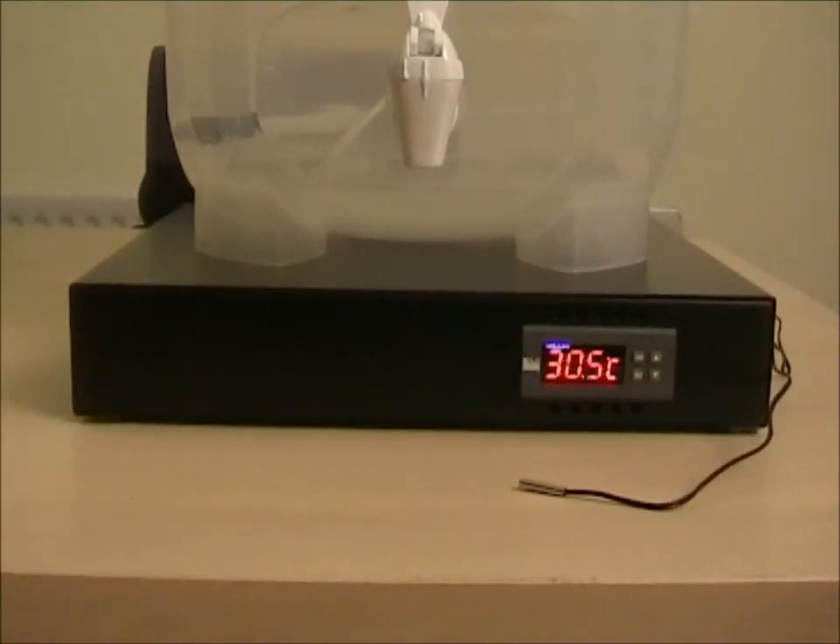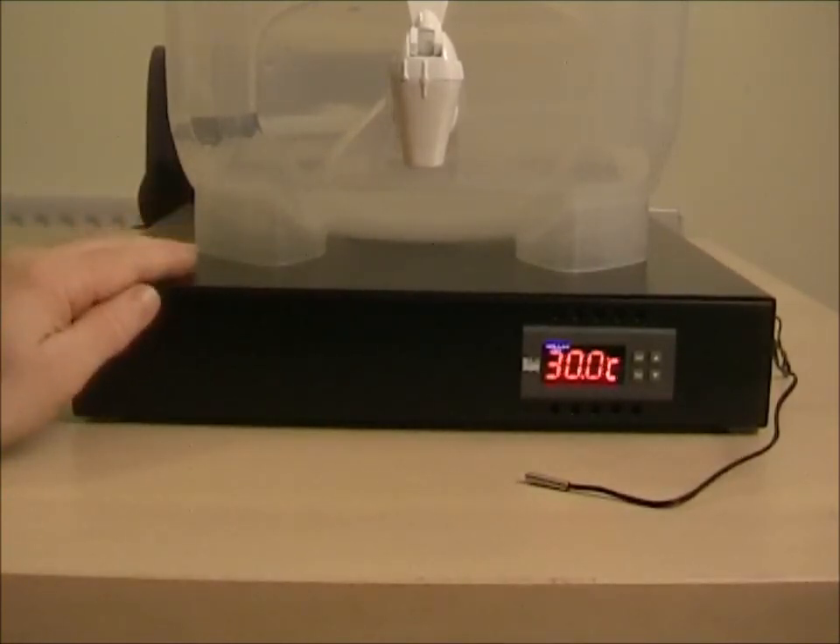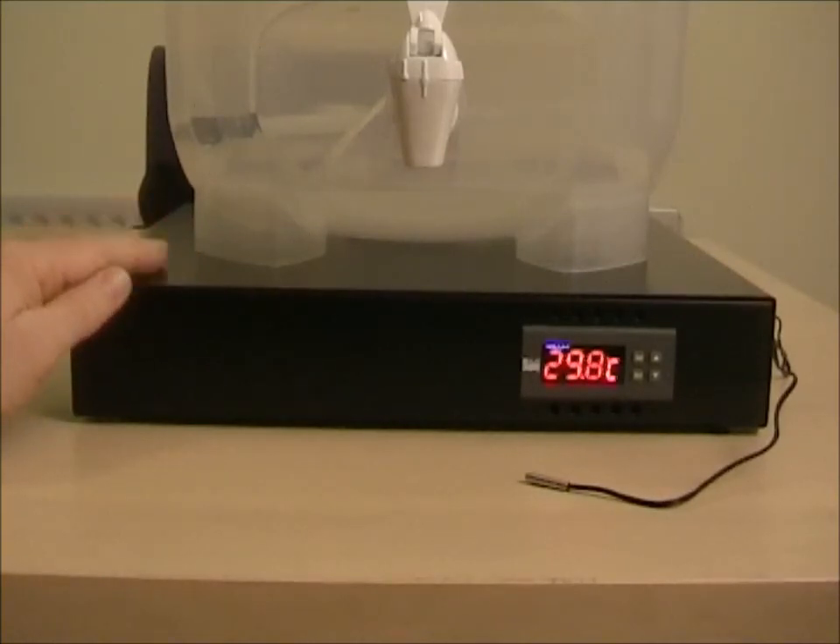So that's really all that most users want to set on the Fermentemp H1, which is a heater only. It doesn't actively cool — it actively warms your brew. So it needs the ambient temperature to be below your desired set point. Thank you for watching.